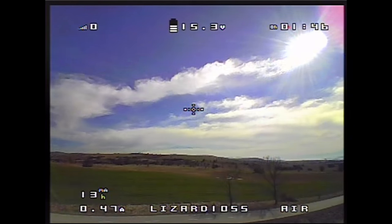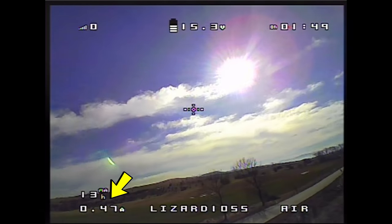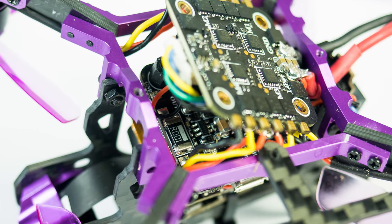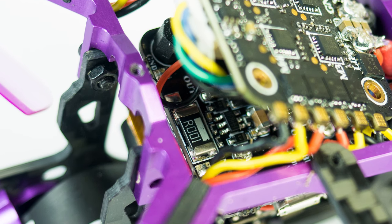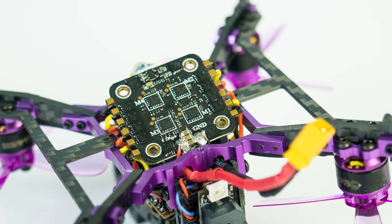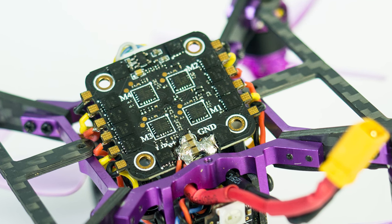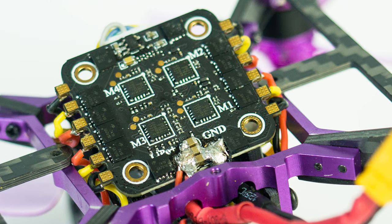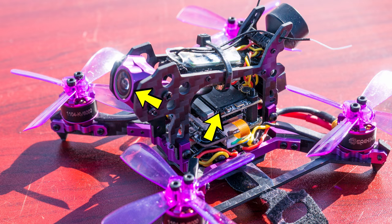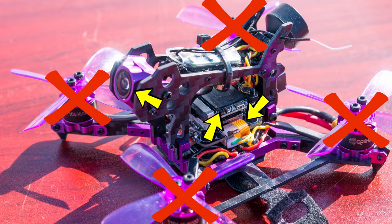Initially I had left the current indicator on the OSD but when I flew it, it didn't change — I thought there wasn't one and removed it. Later on, while addressing the loose lens issue, I noticed that there is a current sensor on the flight controller, it is just that the battery wire does not go through it. Instead it is soldered directly to the ESC, and only a set of very thin wires go from there to the flight controller — so basically I was seeing only the current draw of the camera, video transmitter, and flight controller, not the motors.